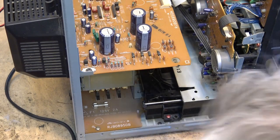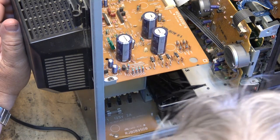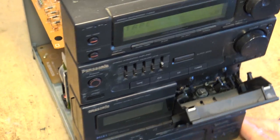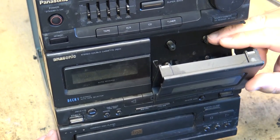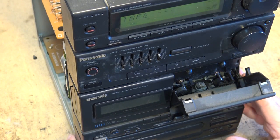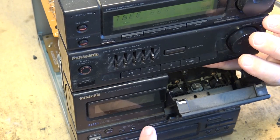I've got to pull this thing apart. I'll get the tape decks working — quite often what happens on these tape decks is these ones have little detector switches located up in the top that detect if there's a tape in place or not. They're also used to detect the tape type — whether it's metal or chrome — and whether the record tab is missing. Sometimes these little leaf switches get dirty, especially if they haven't been used for a while, and they won't detect that tape is there. I'm going to try pressing these switches manually to see whether this thing will do anything.